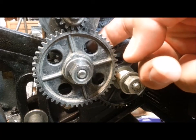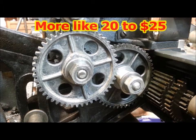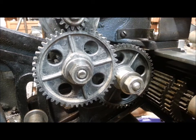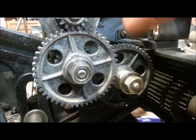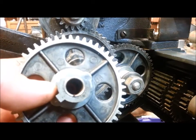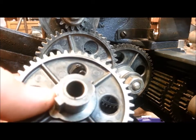You can probably buy a 24-tooth gear on eBay for around 10 to 20 dollars. A whole set of change gear wheels is about $200, but individual gears are in the $10–$20 range. All you have to do to achieve this is buy one 24-tooth gear and you can make this setup. You'll still have your 40-tooth gear, so you can always revert to the old setup and get the machine back to stock.